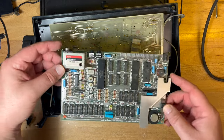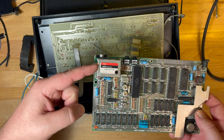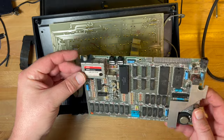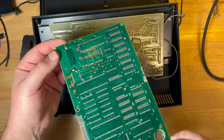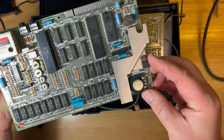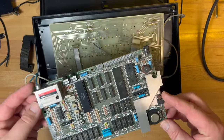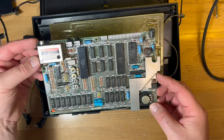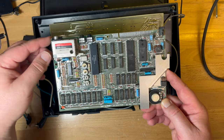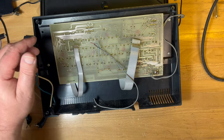So this is my first genuine Spectrum. On the Spectrum Plus it was a pretty simple mod — I think it was just an electrolytic that kind of hung out here to do baseband composite. I'll probably have a look at that and obviously replace the regulator as well. I do have a book on the Spectrum ULA that describes all the different patches and bodges, so I'm going to have a look at that.